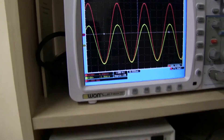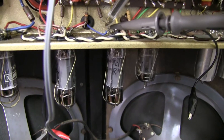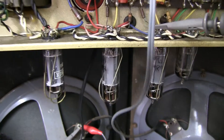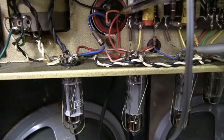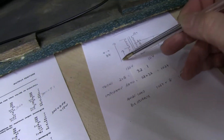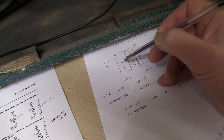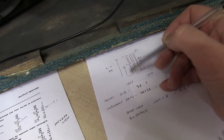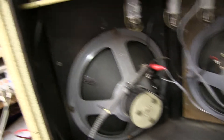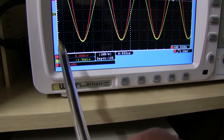The red one is connected on one of the primaries. It comes in on that blue wire to one valve, and the other one comes in on a pink wire down there. And the center tap, which is basically the same as an earth, is the red one in the middle. So we're actually going to be measuring the voltage across where one valve is, which would be one half of the primary. If we could disconnect that point open circuit we could measure across the whole thing, but I'm not going to unsolder that. I've set the scope on the red one, which is measuring the side with the valve.